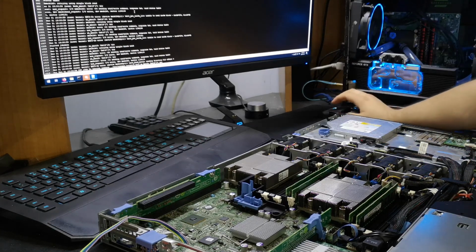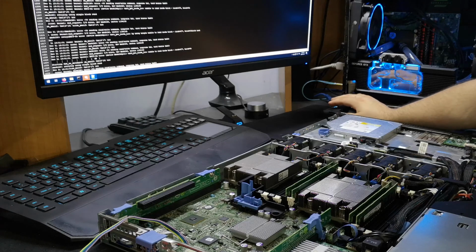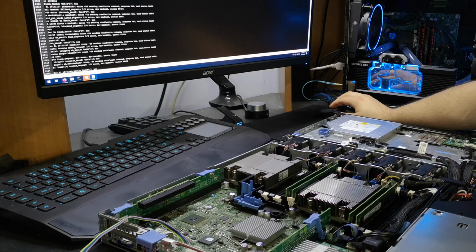And I'll post a log of this too. But it looks like it's basically trying to read the IDRAC configuration or something. And it just doesn't get a response. Card sh_mmcif. It's apparently just unable to do that, and it will continue looping like that. Aside from that, it can see when I have an SD card in there or not, and it actually gets that information. But it looks like it just gets to a point where it infinitely loops. Just a read-write command error.